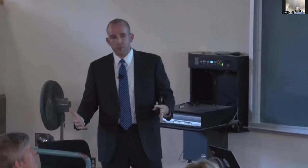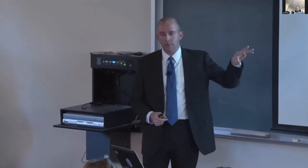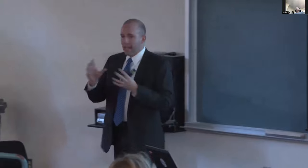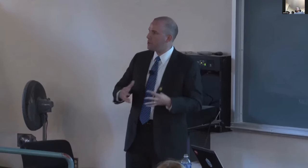Over the last couple of years, we have been investigating a new type of clutch that's electrically controllable but still lightweight and low power. It is composed of these flexible electrodes. This is aluminum sputtered mylar with a dielectric coating. And we place the two electrodes on top of each other like this and hold them in place with tensioning springs. When no voltage is applied, they slide freely past each other. When we apply a voltage, they withstand large shear forces. You put a spring in series, and now we have a system very similar to the one from the other device. If we put several clutched springs in parallel, now we can select the overall stiffness of the device.